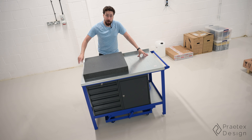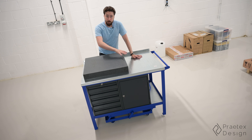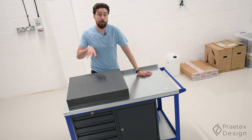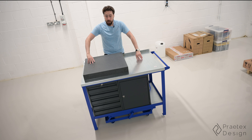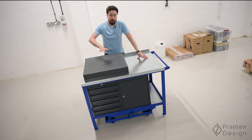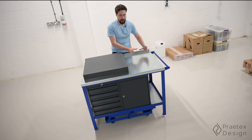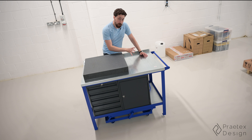This particular workbench is pretty cool as well. I wanted one that's going to be a bit mobile so I can move it around the workshop quite easily, and that meant having wheels. The issue is wheels aren't very precise — they can squidge and move around even when you have brakes, especially with a lot of mass on top. This workbench has proper legs as well, so you can get it really level and it just won't move. It's a fully welded frame, so it's not going anywhere. I've also got plenty of space to fit a laptop and something rather special that I'll reveal in a few weeks — it's really, really cool, but I have to learn how to use it first. If it all goes to plan it could be quite the game changer.